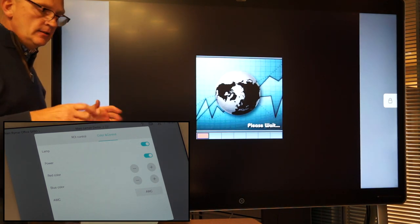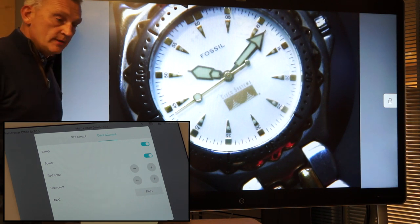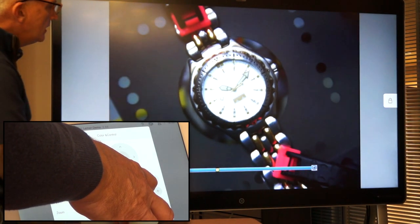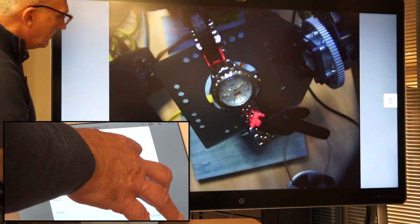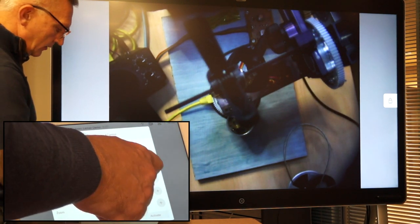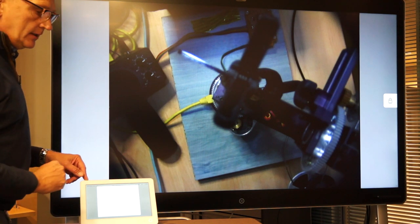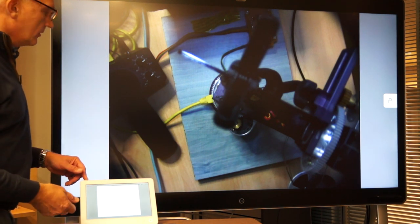While it's switching on, I can explain what's on the other side. I have an A680. On the RS232 connectivity of my A680, I have an Arduino — very simple. And this Arduino is controlling a pair of motors that are located on this articulated arm. If I zoom back, you may see the plateau where I put my watch, and on the right side the wheels. And I can also move it and you can see it. So over a video communication which is encrypted, I'm sending from my macro tablet text commands that are encrypted, decrypted, understood by my Arduino, and I can pilot my motors on the other side. And that's it.